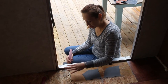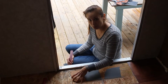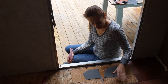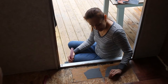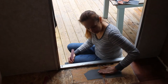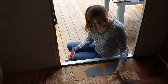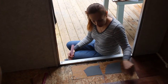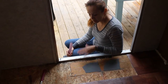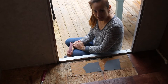We initially fixed the rot right here by the door frame — we took this piece of wood, cut it out, and replaced it with a brand new piece of plywood. We had inserted a brace underneath, but apparently the brace did not hold the way it should have and over time it left a little bit of a gap. Every time you step on it, it kind of pushes down and that caused some of the vinyl tiles to crack. So we went ahead and removed the vinyl tiles, and we're going to take this piece of plywood back up, find out why the brace didn't hold, fix it, and then retile it.